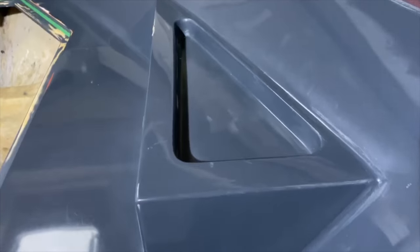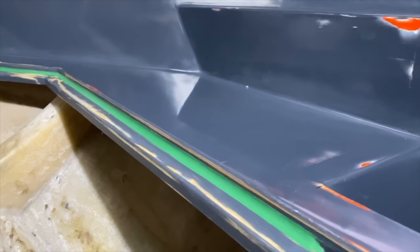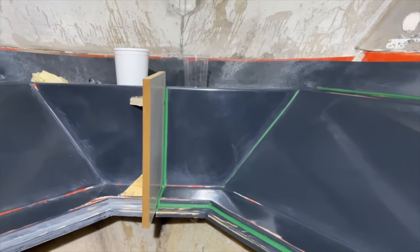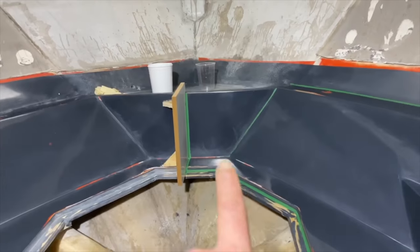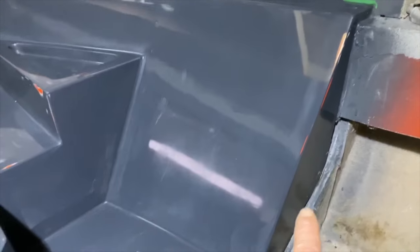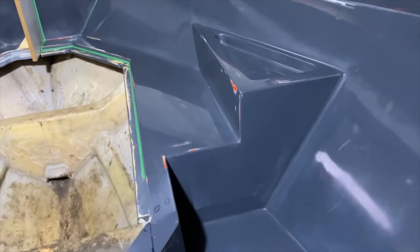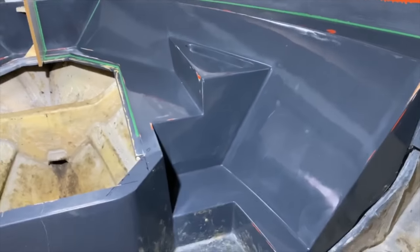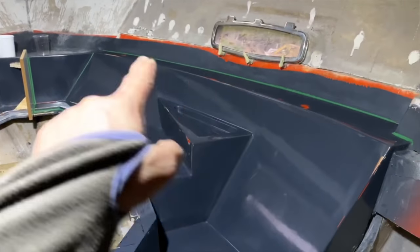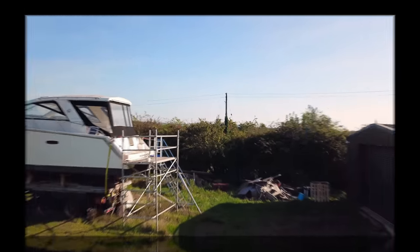And we've also waxed inside there. And also all the way down this edge, plasticine again, and mould up to that break there. So we'll be moulding from here all the way to this back piece here, and then down, across, and up there. So that's going to be the wrap for today, guys, and we'll be back with the next video, which will be applying the OptiMould and gel to this part of the moulding.